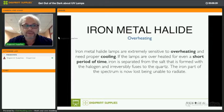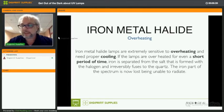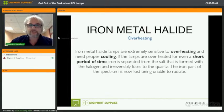That means that you have to meticulously replace the filters and take care that the fans can operate freely and in good condition. So vacuum clean the fans, for instance. Okay, and also the airflow. You need to keep an eye that everything around the UV lamp cassette or housing is clean, and that nothing can interrupt the airflow around those lamps.